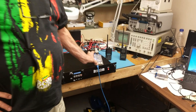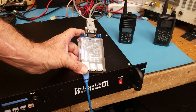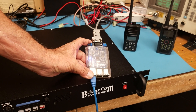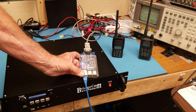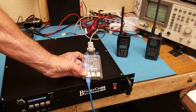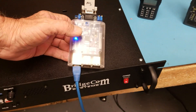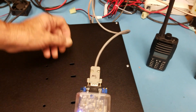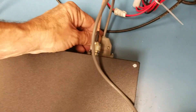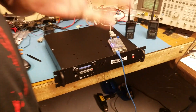The version we're running is the Scott Zimmerman board, the N3XCC Pi Hat, Scott's version 3, which is the blue board. It does five digital modes: D-Star, DMR, P25, Fusion, and NXDN. With a 12-volt to 5-volt converter, it will power off of the BridgeCom accessory port. We have a single cable going on a DB25, and that's the only interface to the analog repeater.